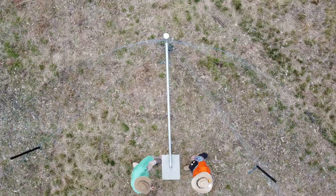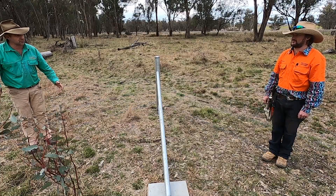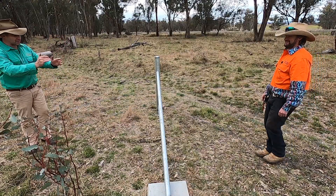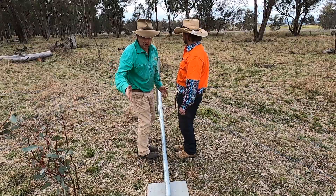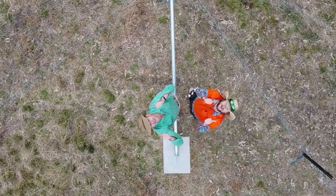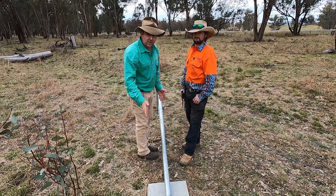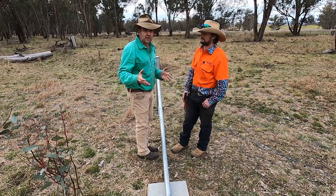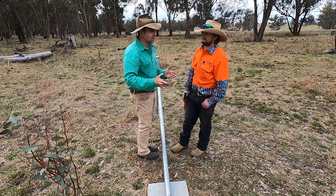We've done a reasonable job at getting a circle there — about as good as we're going to do with our tape measure. Now we're going to walk straight into each other, and that ladies and gentlemen is your new effective stay length if this stay was actually two, one on each fence line. We've shortened that by a metre. We've therefore created more of a tripping point and we're going to end up with jacking corner posts more easily — not necessarily always the case, but more easily.